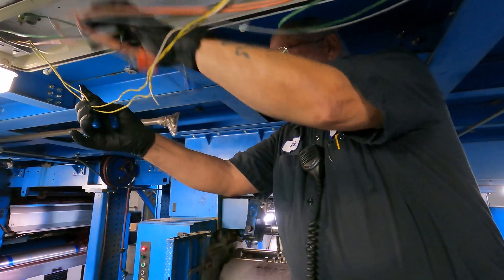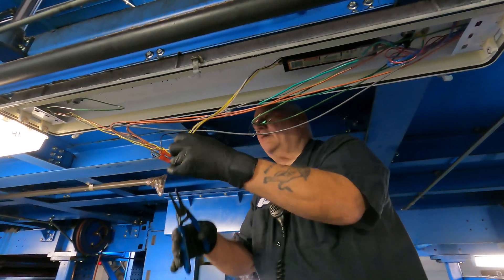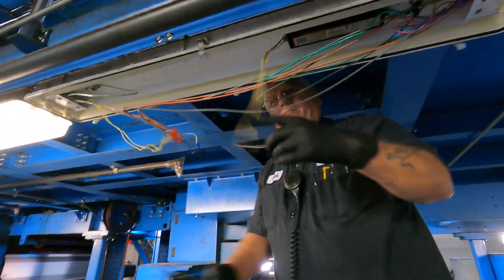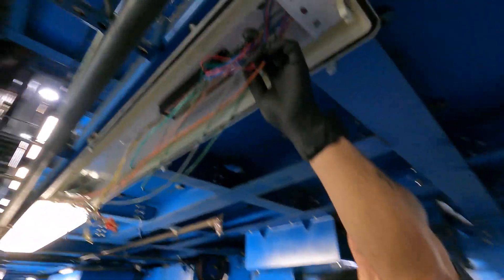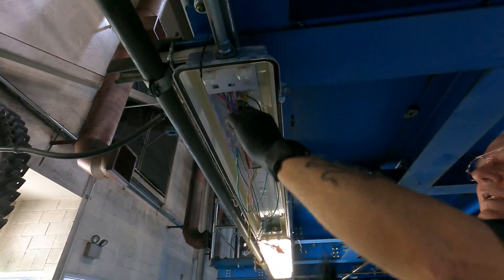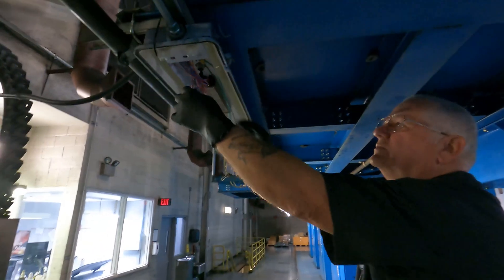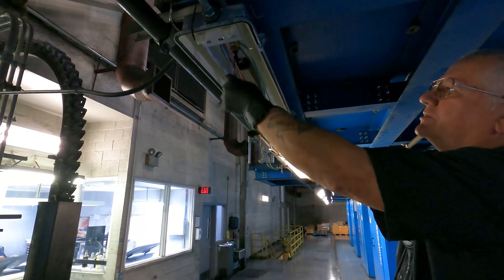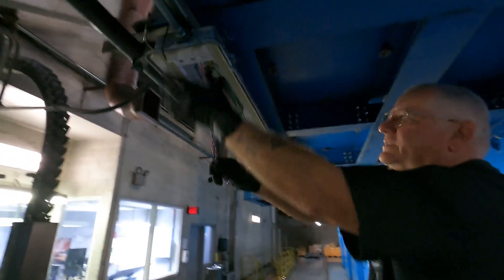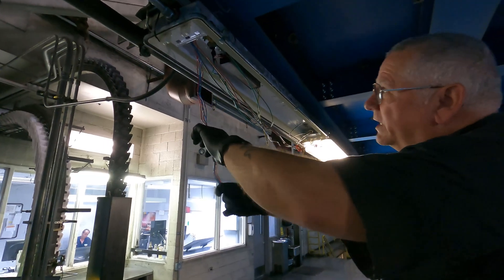So I want to cut these yellows out. Go to your ballast. I'm gonna make them real long and I'm gonna make the ones off the ballast short — cut them off, let them hang. Just make sure you got strictly the lights, nothing else when you cut it, because you got hot leads going by from light to light to light, so you gotta watch so you don't cut the wrong wires. These are going to your light sockets. Now the ballast is completely isolated — you can remove the ballast and put the new ballast in.